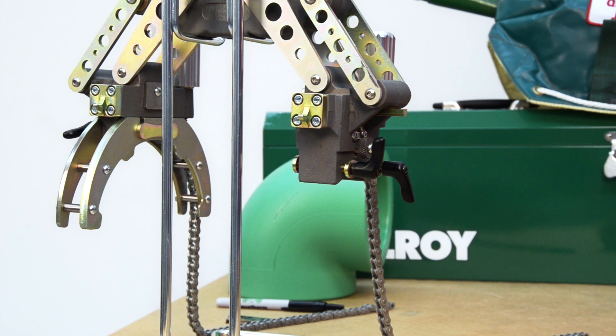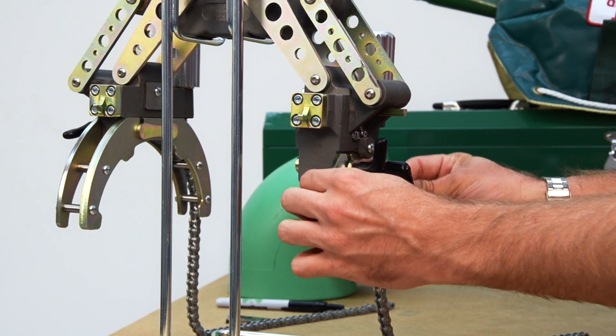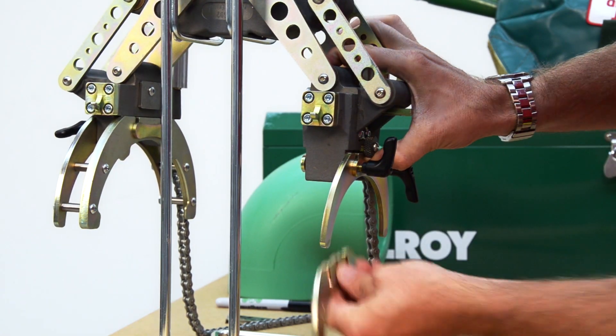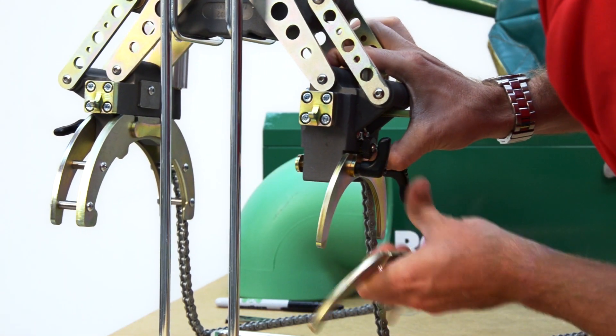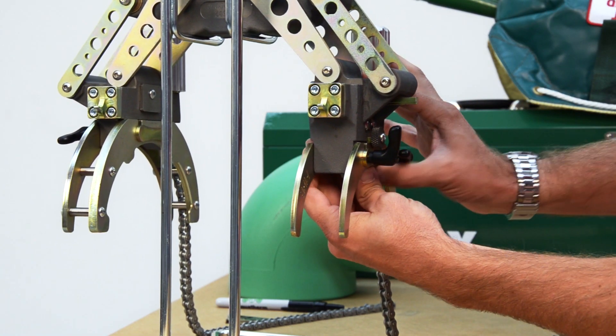Just like the fitting side, two inserts will need to be used. These inserts have a groove in the middle. That groove needs to face in towards the shorter mounting block. You'll use the black clamp knobs to ratchet the inserts tightly to the jaw of the Spyder.